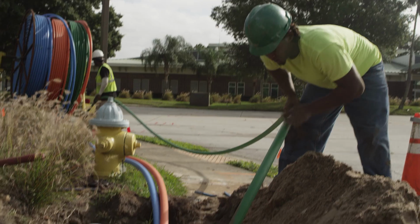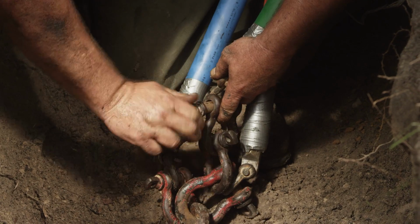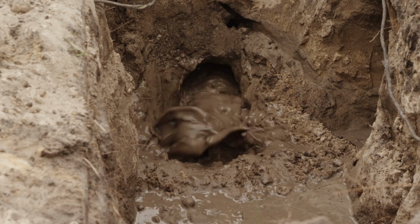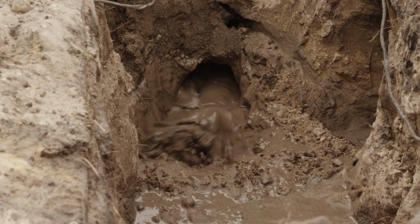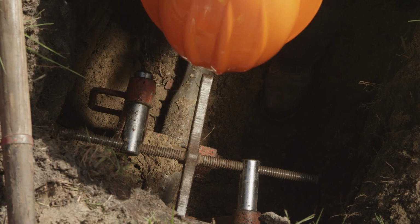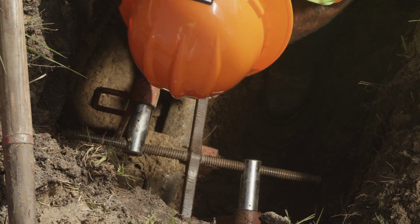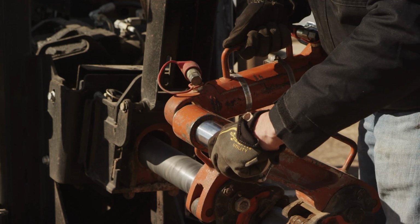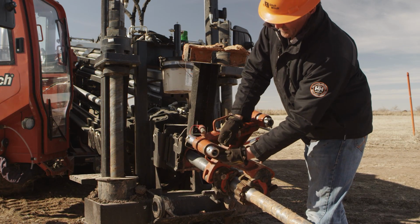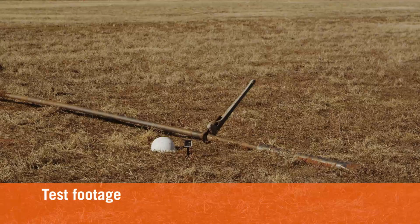Drill string thrust and rotation must be shut off while breaking joints, changing tools, and connecting product. Do not enter any pit until the operation of rotation and thrust is disabled and verified. When adding and removing pipe, always use the appropriate breakout devices such as quick wrenches, hydro tongs, or easy connect. Never use pipe wrenches, machine power, backhoes, etc. to loosen or tighten downhole tools.